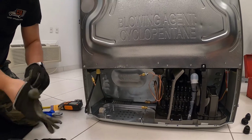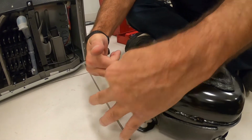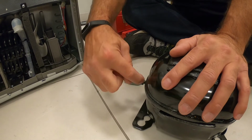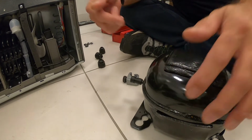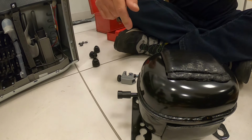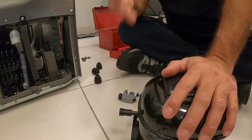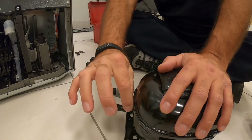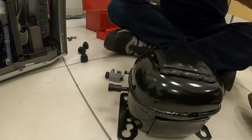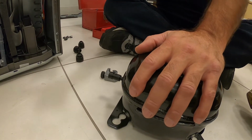When we changed the original compressor, the tube goes in, and instead of cutting here, we cut here. So we sand this pipe, and we use this pipe for the next connection. This one is 8 millimeter, and the one coming is 6 millimeter. Usually your Lokring is 6 to 8, but you also have an 8 to 8. So when you cut here, this is 8, so it stays 8, and the new compressor has 8, so you do an 8 to 8 connection. It's straight pipe, so there's enough straight pipe, you don't need to recut again. That's what we did with this one.